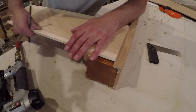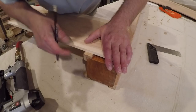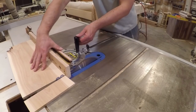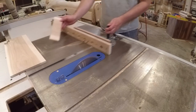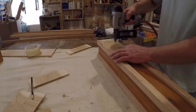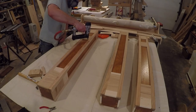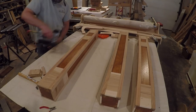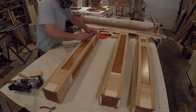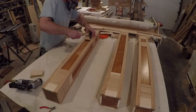There are three rail elements to the post: one at the bottom, one two thirds up, and one at the top. This design element came from the doors in the rest of the house that had the same panel design. I started out by marking and cutting each piece as I worked my way around and up the post. When installing the middle rail, I used a spacer block to be sure they would all be placed in the same spot and to save a bunch of time not having to measure for each one.